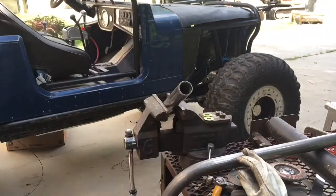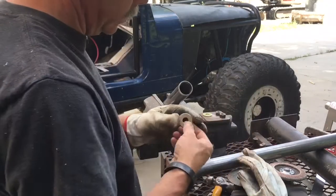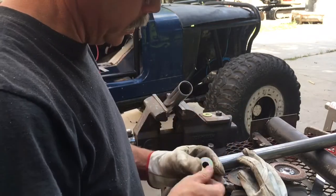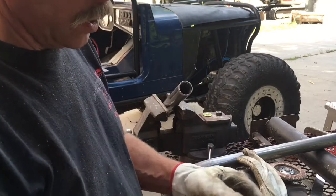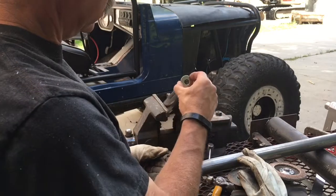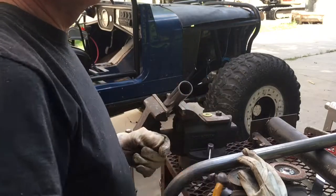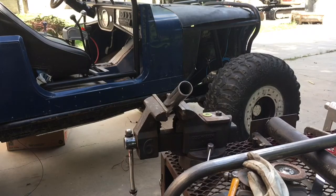What I've got is a couple of grade eight cadmium-plated washers. You don't want to breathe that when you weld on it, so I'm going to try and clean that off first. I've also got some grade eight weld-on nuts, and I'm just going to weld the nut onto the washer. Then I'll put a bolt in it, hold that up inside there, and weld the washer to the inside of the tubing. That'll give me a method to attach it to the car, so let me get my sander and clean these washers up.